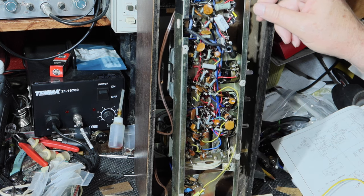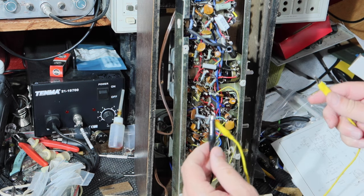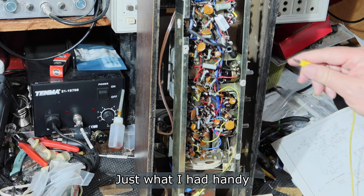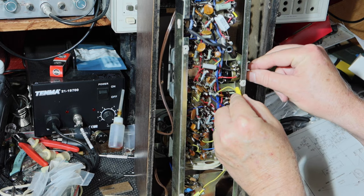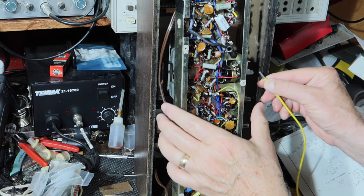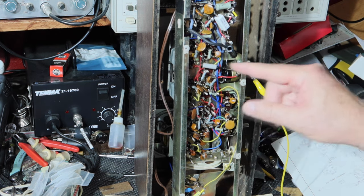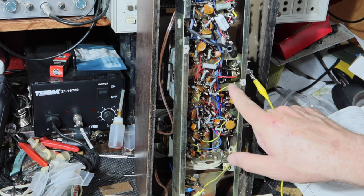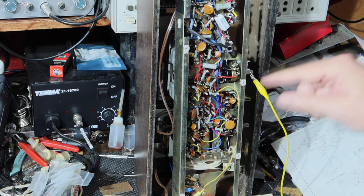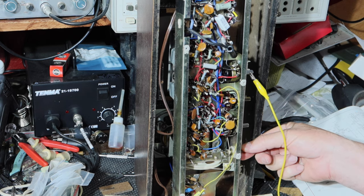So I think what I'm going to do is hook up a capacitor. It's not much voltage there. I've got a small capacitor, it's a 47 at 35, so that takes it out. It's kind of the same thing there. So between this getting rerouted and putting some filtering with the capacitor off the can of the volume control, this is now back to being pretty tolerable. I mean, you really can't hear it.